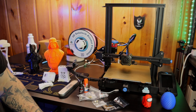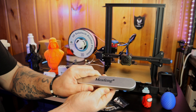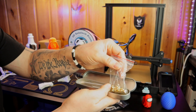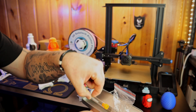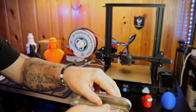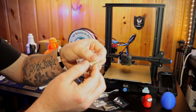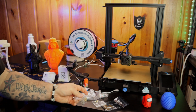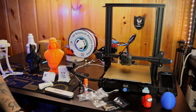This is also a good thing to get — from Amazon, it's like eight or nine bucks. You get a kit of about 40 extra nozzles plus cleaning rods to poke around in your nozzle and clean out clogs. These aren't the highest quality nozzles but they work great. I also have some TH3D nozzles here as spares — these are definitely a higher quality brass nozzle. But the cheap ones work great; most of the stuff I've printed was done on the cheaper nozzles with no issues at all.